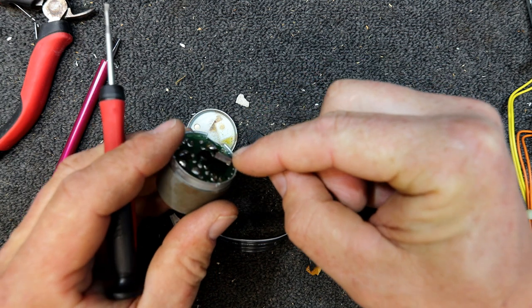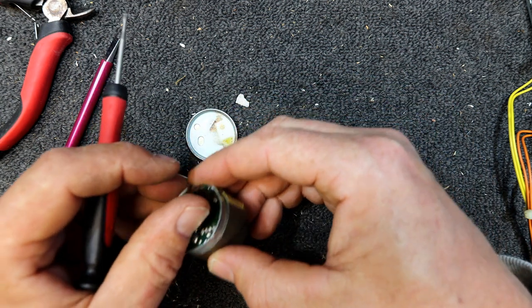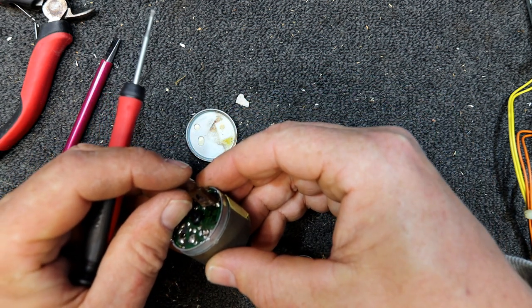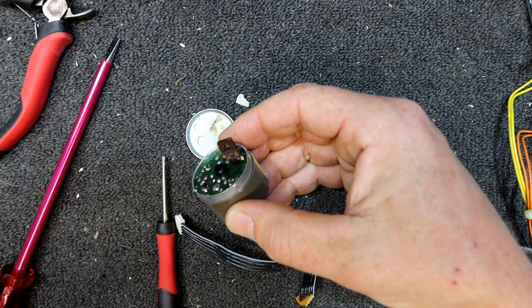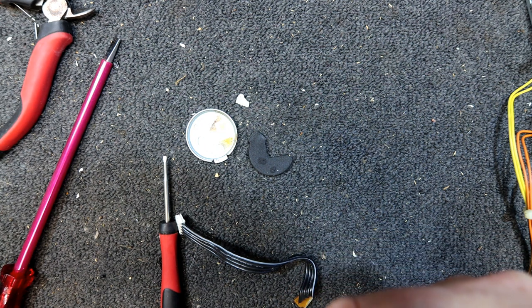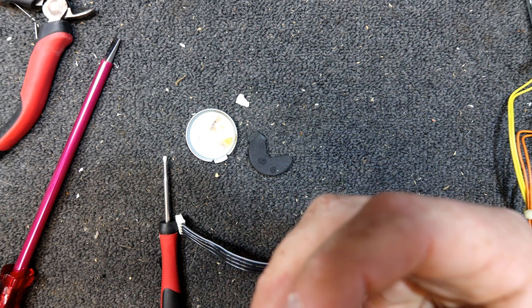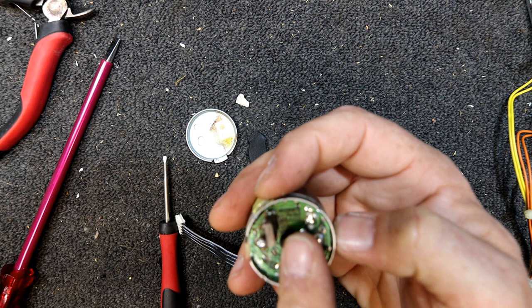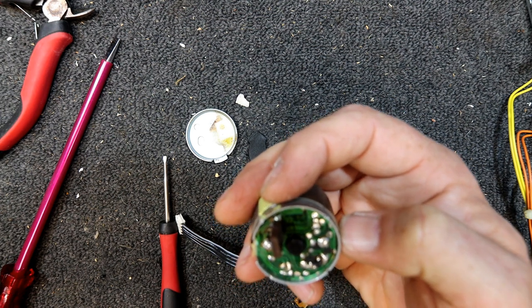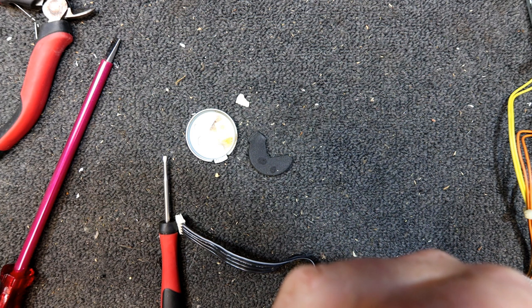Should be a little AN in there, it's a brown colour, so yeah, guaranteed that is cooked. What does it say on it? It's not an AN, I don't think, it's a C. C or D? Yeah, C1470LM and 439M. And it's got a Sanyo symbol on the circuit board under there, that circle with the little triangle bits in it. Something, oh, the RU mark, or the backward R thing, whatever that approval rating thing is, and then T002.